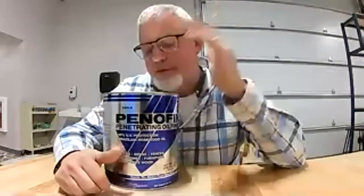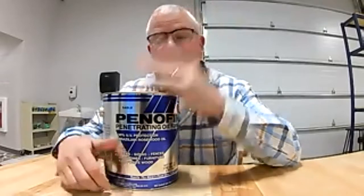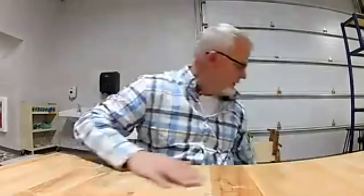This will prolong the life of your outdoor project. I'm not endorsing this. This is what I use on my deck at home. It's simple to apply. It has a lot of pigment in it, and it requires lots of stirring, okay? And it is a solvent-based product, and just like anything else, you still need the same cleanup. It's going to be mineral spirits cleanup, and any rags need to be disposed of in the red metal container. I only use this on exterior projects.